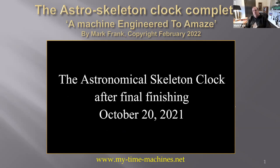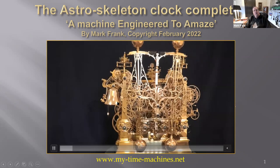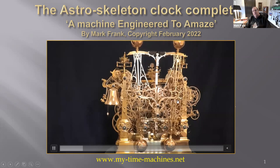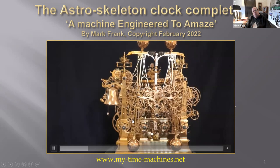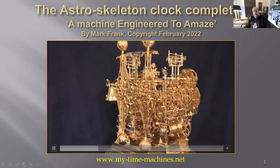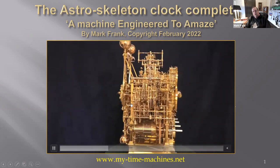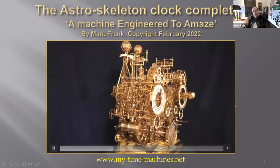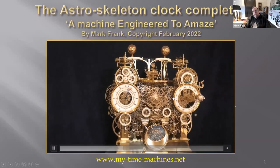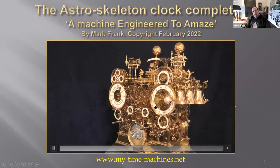And then if something does go wrong deep within the clock, which I hope I never live long enough to see, you can remove these three main pieces right down to the frame. Now, I'm not going to pretend it's easy because you've got all of the strike work that runs across all three of these, as well as some other wheels behind these pendulums, but it can be done. And Buchanan has shown on a film how that is done, removing all of the strike work and so forth. And then these three main frames do come away.